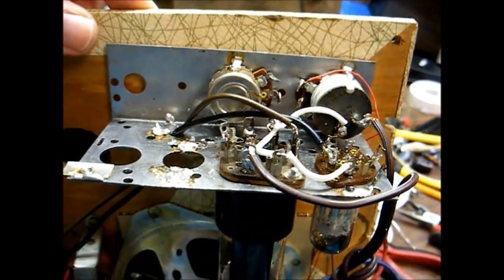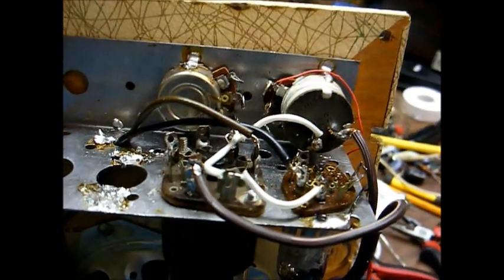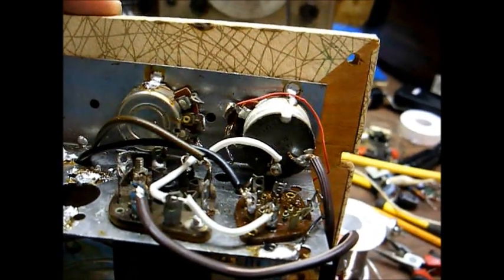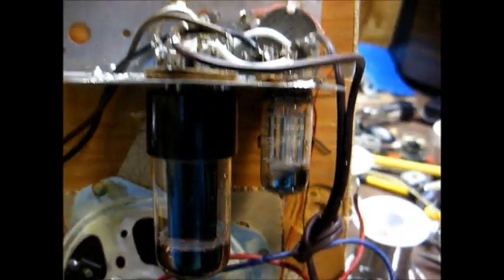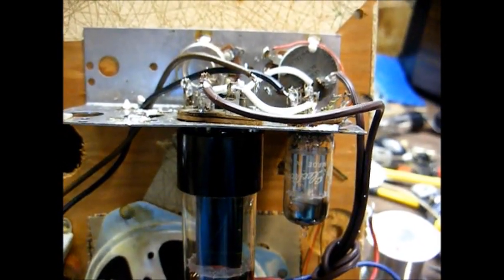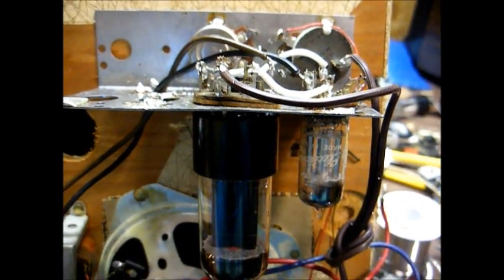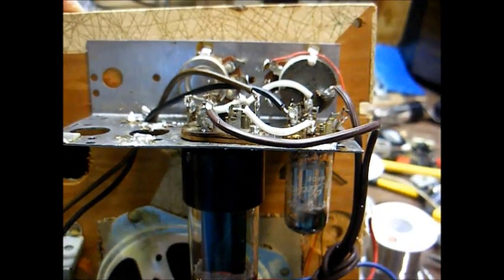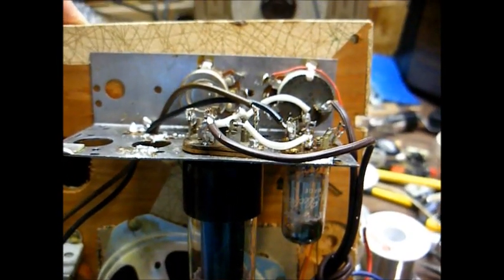We now have our filament and motor circuit wired. These white wires are our ground connections, wired using uninsulated bus wire with tubing slid over the wire to keep it from shorting out to anything. As you can see, our tubes are lit up and our motor is running — so far, so good. If you're inexperienced in doing stuff like this, it's best to check your progress as you go. That way you won't run into trouble once you get the whole thing built and then have to dig back through all of your work to find out what went wrong.